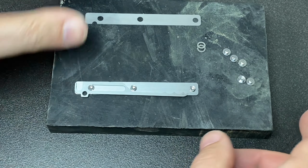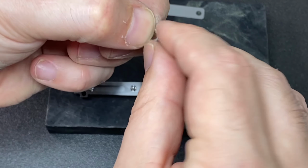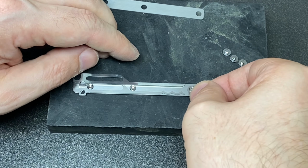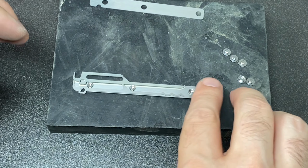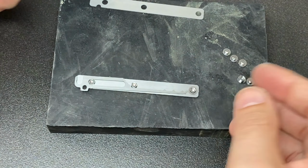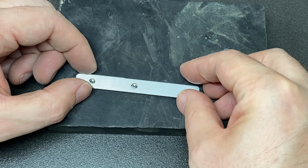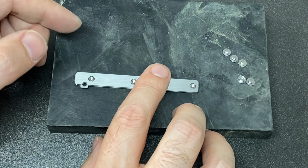Then you put your spacers, very important, really important, these two, just there on the third screw, because if you don't, then you'll basically have a weird tapered set, and it'll pinch and you won't be able to get the pick tools in and out properly. And it's relatively stable like that. I'd suggest having a soft work surface instead of a hard one to work on. And then you just pop the second scale on top, and that should be a really nice fit.